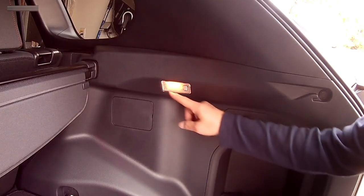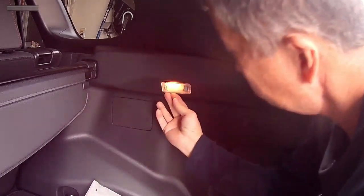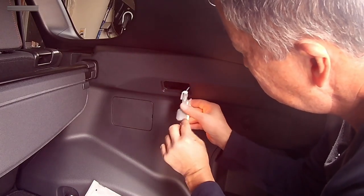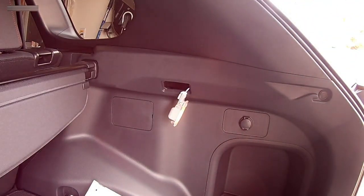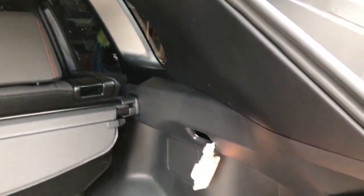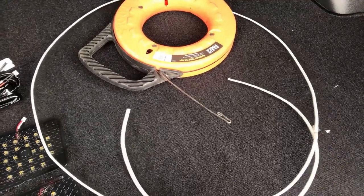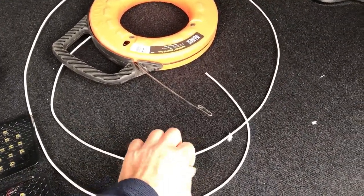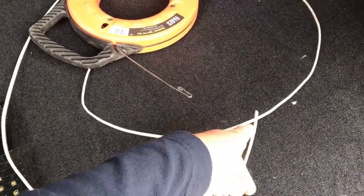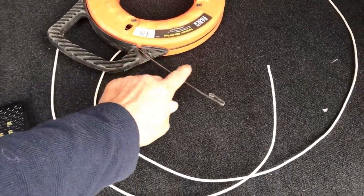So the first step is to open this light. I'm trying to be gentle so as to not scratch or mar this brand new finish. I need to fish the power cable from here down to where the light is. I could use a typical electrician's fish tape, or I saw online somebody using a USB cable, but I think I'll try this 16-gauge solid electrical wire — it might be a little more flexible than the stiffer steel fish tape.